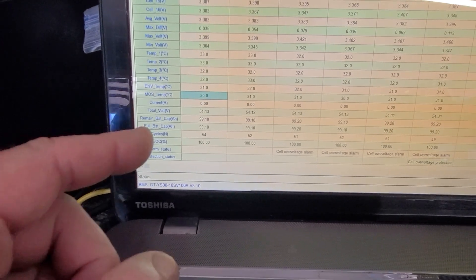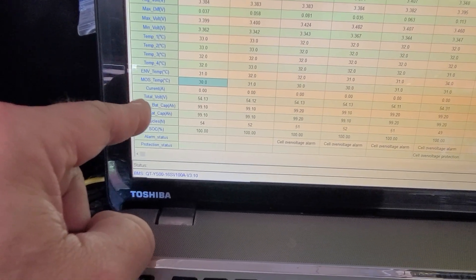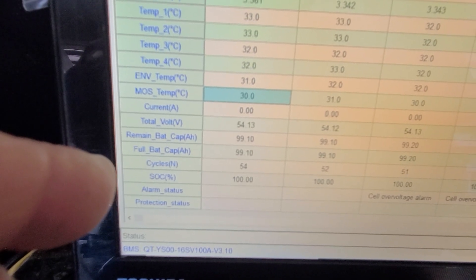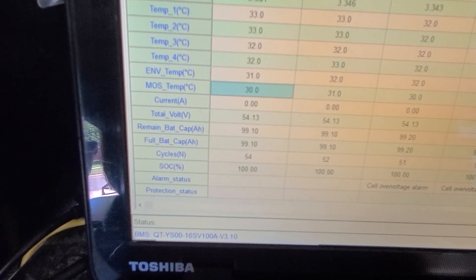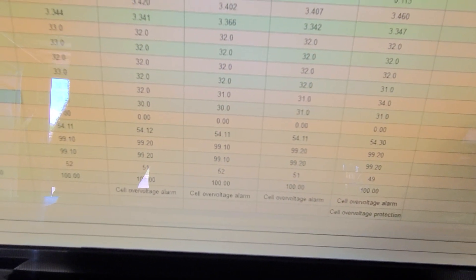When I was watching these come up, the total voltage — let me get a little closer — none of them actually reached 57V. The closest was 56.8V on the individual battery voltage; most were around 56.3 to 56.4V. So they didn't even get close to 57 volts, and those alarms will all go away.